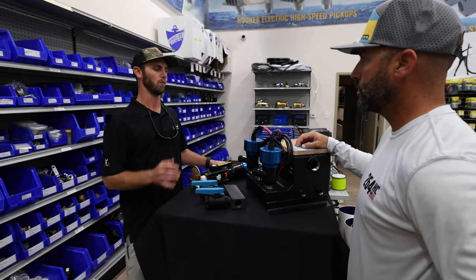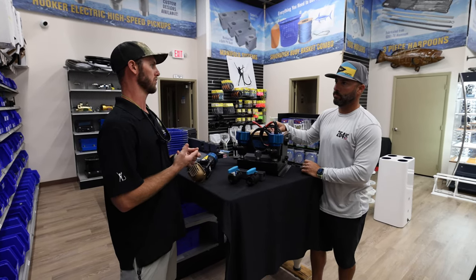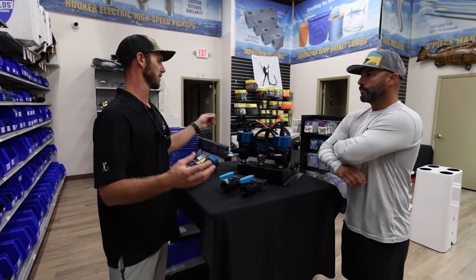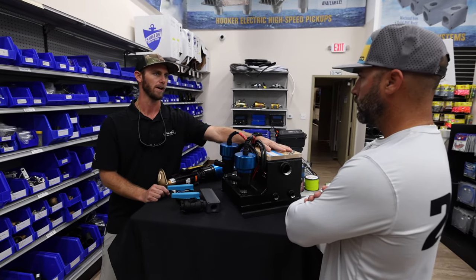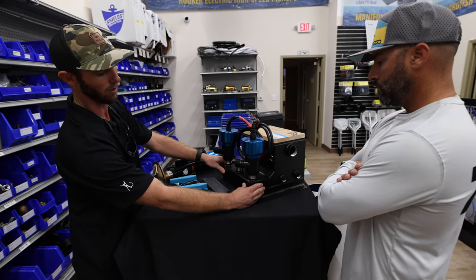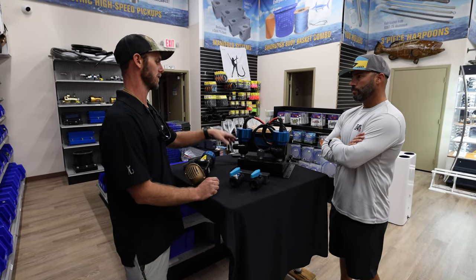A question customers ask a lot: why do I need a sea chest — why can't I just go directly to a through-hull with the pump? Either way works. But if you have a step-hull boat or a catamaran, the nature of those boats is to pull a lot of air through the hull. In that case, you're most likely going to be sucking up air if you went directly to a through-hull. What a sea chest does is divert all the water — the intakes are at the top, air naturally rises, and there's a breather check valve that lets air out but doesn't let it back in. The pumps pull from the bottom of the pump box where it's all clean water, separating air from clean water for your pump system.